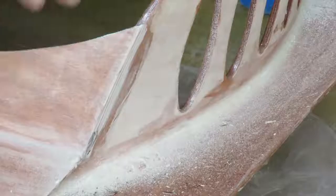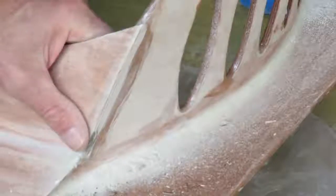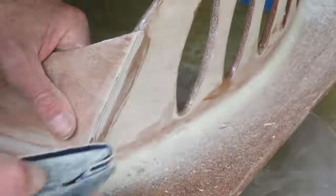The coaming overlaps the back of the seat, so there is a fillet back in behind here. So that's going to add to the strength. And we'll clean up this front surface a little bit. Now remember, your varnish isn't going to hide anything. So clean things up to the extent that that's the final look. Your varnish will actually accentuate any differences, if you forget to sand all the black out, or if you haven't sanded the epoxy off the surface here so it's smooth, your varnish is going to accentuate those differences, not cover them up.